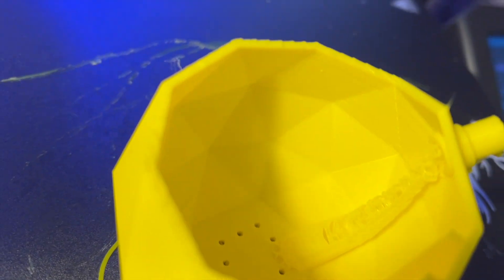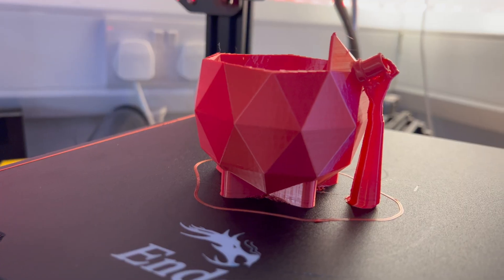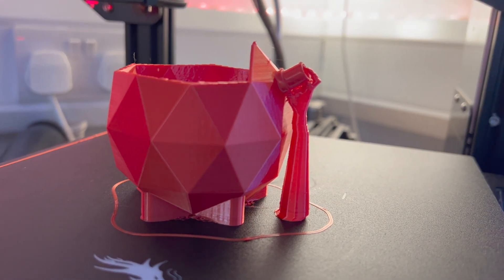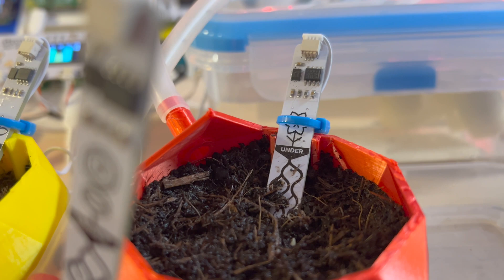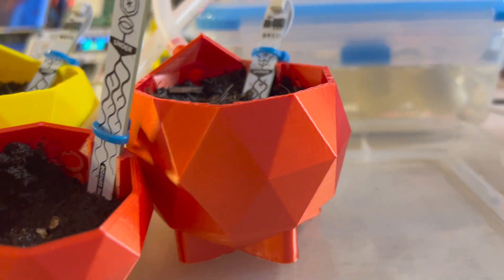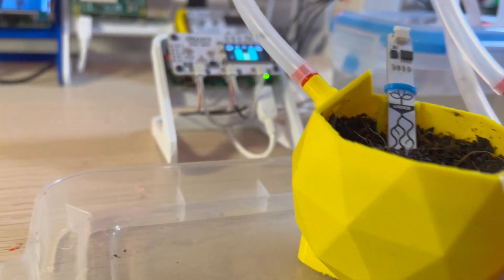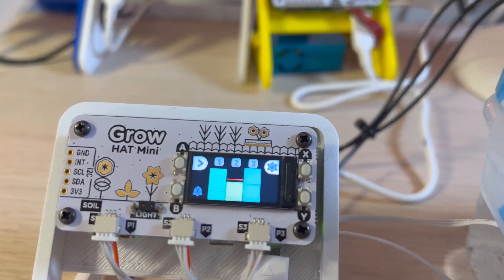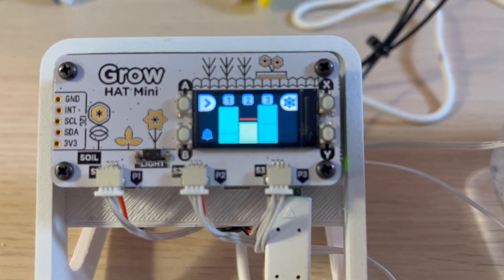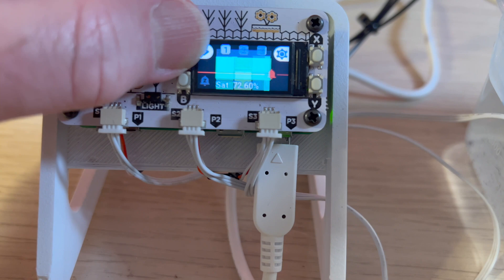The changes I've made: I've made the feet much wider so they cover much more of the base. I've also made the watering inlet pipe much higher up so that it flows on top of the soil rather than underneath it. Here's the finished result — the soil sensors are much deeper into the soil and the water inlet pipe is above the level of the soil. These are significantly larger and the amount of soil and water that can be in there is also larger, meaning they are more stable. This is the Grow Hat Mini on the nice little Pi stand — it sticks there very stably and you can also change the user interface with little buttons on the front.